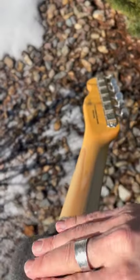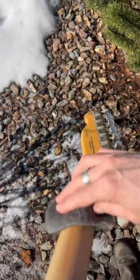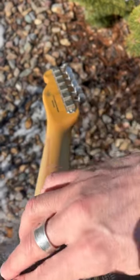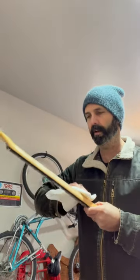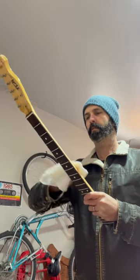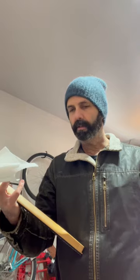I'm not going as steep a V on that one. I don't want to take too much material off because it's hard to put back on. This is after the first layer of linseed oil — quadruple aught steel wool — then dried tung oil. I've heard that tung oil is more water resistant and dries a little quicker than boiled linseed. I also read that I could use Japan dryer to help this dry, but if the whole point is getting the oil into the pores to seal it, why would I put something that makes it dry faster? I'll just put it on there and leave it for a day. No shortcuts.